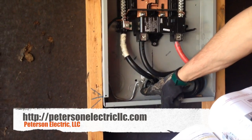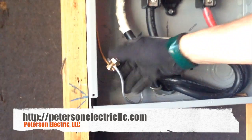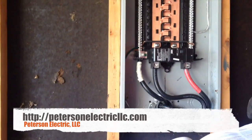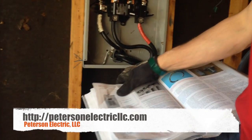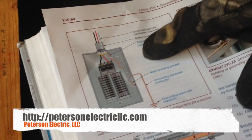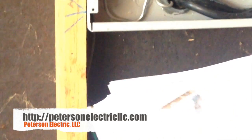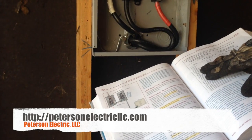He said I should be at a number 2 aluminum, but this was already here and he kind of let that go. I put in a split bolt here and extended it to be a number 4 copper. And here's the other thing he's talking about in here — this is going to be called the Supply Side Equipment Bonding Jumper. That also talks about how to size that if you have to — that would be sized off 250-102C1.